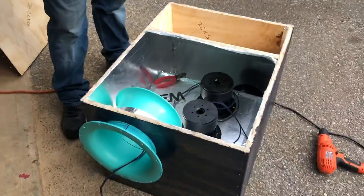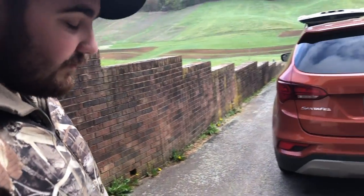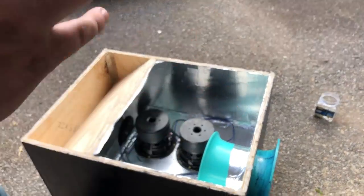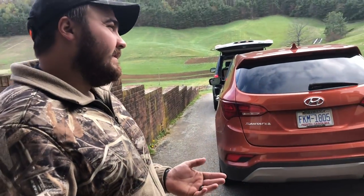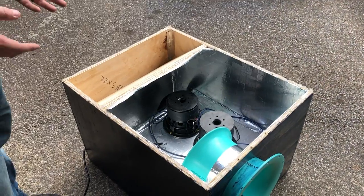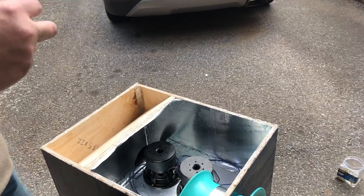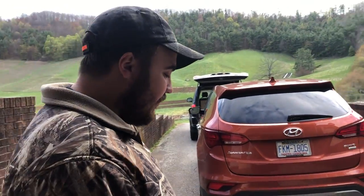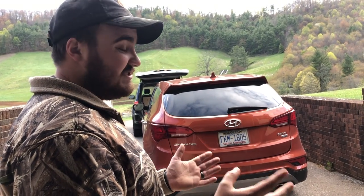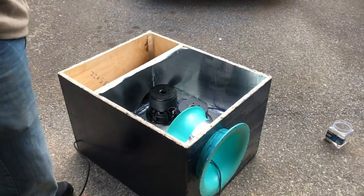What's the advantage of this kind of box versus just a regular ported box? The advantage of this box over a regular ported box would be broader bandwidth if it's tuned properly. It's really all about the tuning between a 6th order and a regular ported box. A regular ported box would peak closer to where you tune it and then roll off. Let's get this thing finished up.